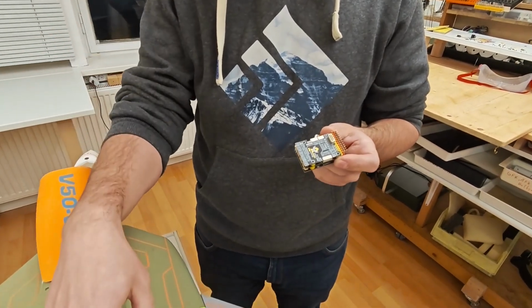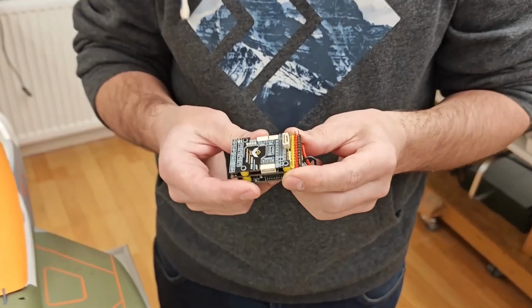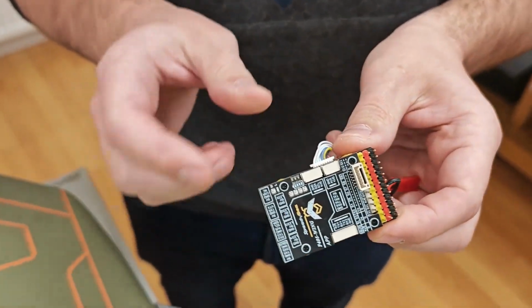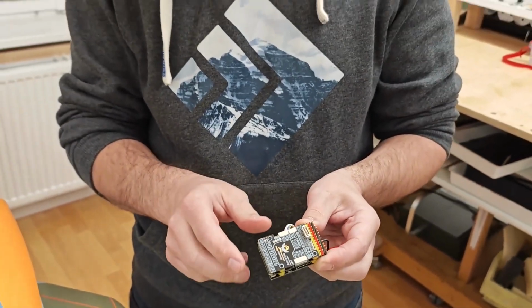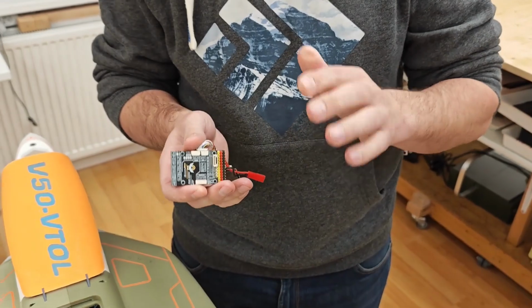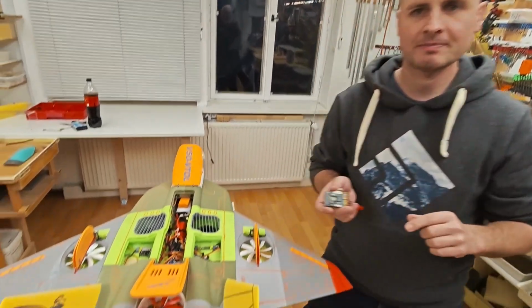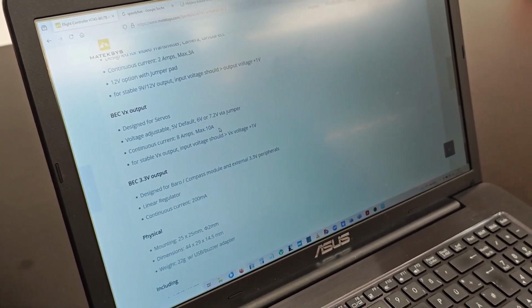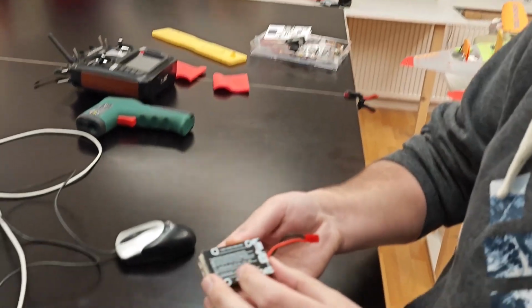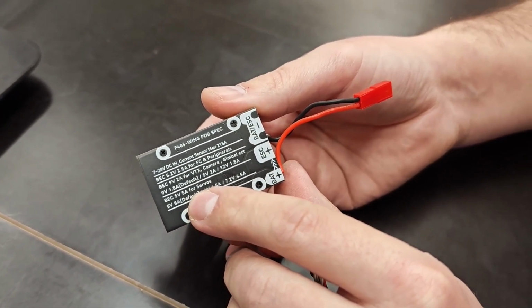You know, in this jet, we got the Matek H743 Wing Lite, but we also used in the first flights the SpeedyBee F405 Wing, and we want to show you now why we finally decided for the Matek board. The main reason was the BEC output. Here on the Matek board we got 8 amps and maximum 10 amps, and on the SpeedyBee, like you can see here, we just got 5 amps, so this is really a lot less.